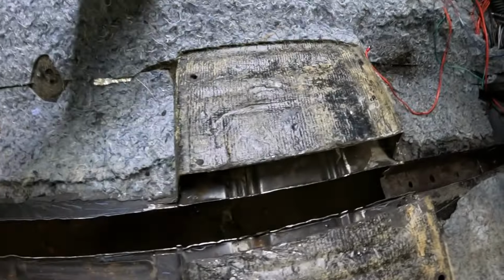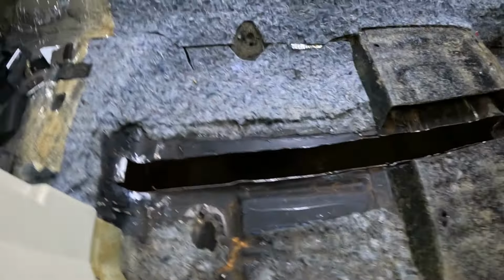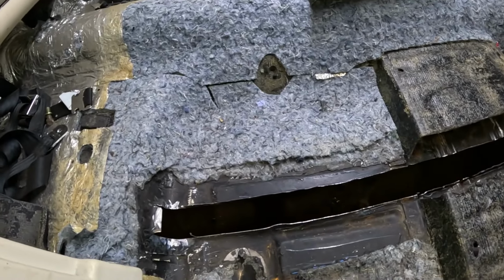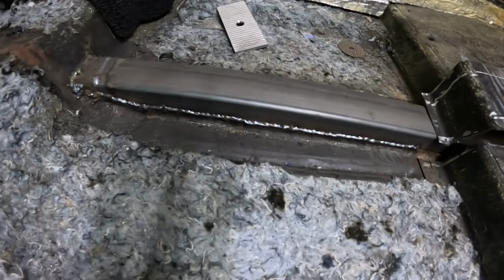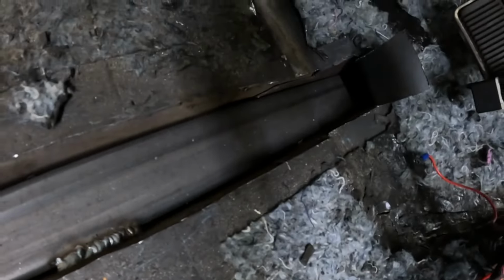Once we cut it through here, we've bent a little flange. You can kind of see there's about a 1/2-inch flange here. We cut it a little too narrow, then folded it up with those duckbill vice grips. That's a little bit oversized, so the subframe connector will push up through the floor. And then we just hammer these edges over to the rail. Now you can see over this side, we've already got one done there. That's the box section coming up through the floor. You can see where it's welded. That little flange is welded onto the side, and that's the box section sitting inside the rail extension and disappearing way up the front there.